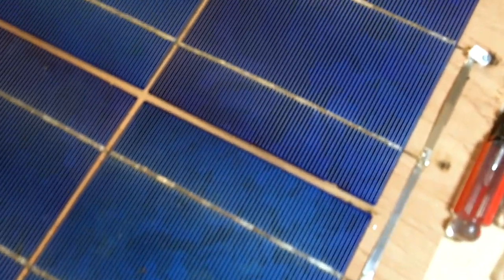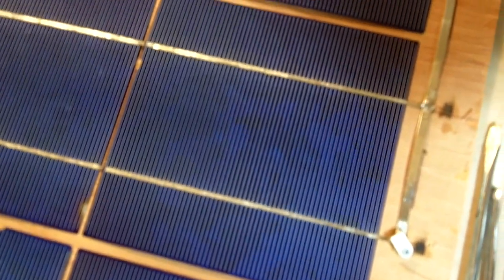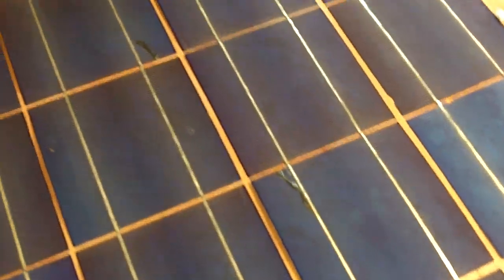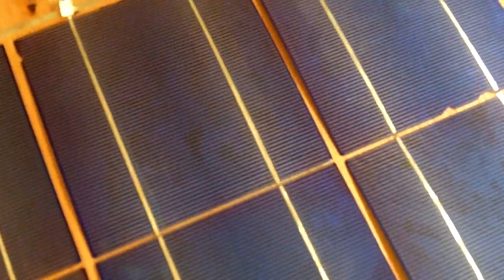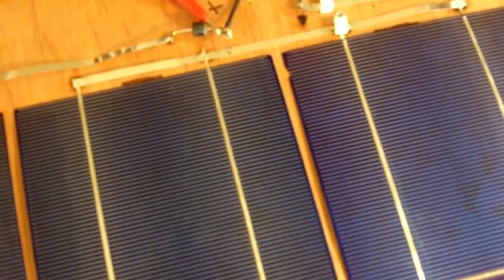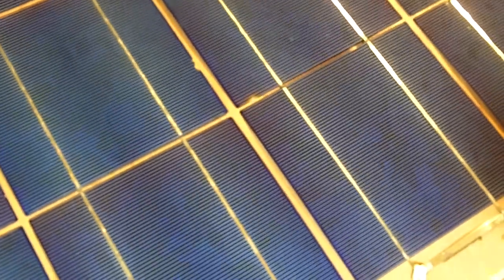There you can see the bus wire — two rows are connected together. The two outside rows are connected together, and then on the other end the outside rows come together and form your positive and negative. Then the two center rows are connected together. I also have a small 10-amp diode so the battery doesn't discharge back into the panel.